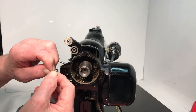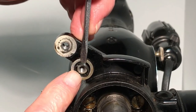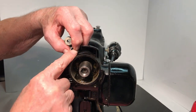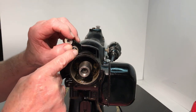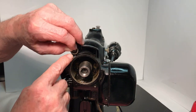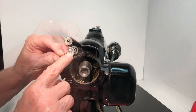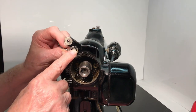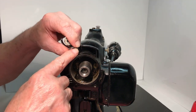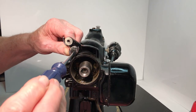Next, replace the latch spring. This can be a little trying to your patience. The spring has a small finger sticking out on either end — one at the 6th position and one at the 12th position. On this particular spring, one of the fingers is ever so slightly longer than the other. Place the long finger to the inside of the housing. The stop latch has a small hole that corresponds with the spring finger. Line up the hole and spring finger and hold it in place, then put the latch screw in and secure the latch.